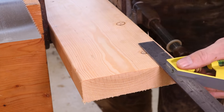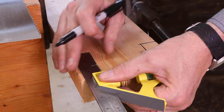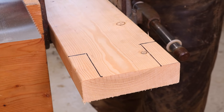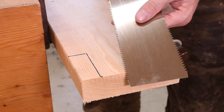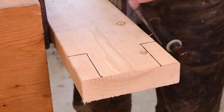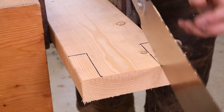Let's see how the saws rip. When you hear the term ripping, it means cutting with the grain — cross-cutting is across the grain. We'll come in 3 inches, which would be common if we were going to cut a tenon. The Japanese saw, if we look close, has two different types of teeth — bigger teeth which are better for ripping, and then the cross-cut teeth. So basically two saws in one. We'll try to be more careful with both saws for this test.